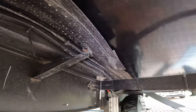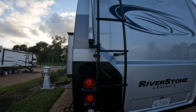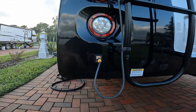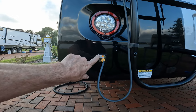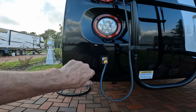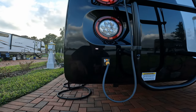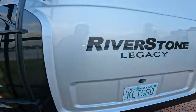We're finished — there it is. The other night it was pretty windy and the wind was knocking the dish against the ladder, so I put some velcro there to tighten it up. Here's the penetration. One thing to note: I said I'd use a spade bit and I did, but it tore out a bit more than expected. I'd recommend using a round hole saw instead — a 15/16th hole saw will work fine for this connector. I put a small plastic border here just to cover the tear-out cosmetically; it wasn't structurally a big deal but I wanted it to look neat.